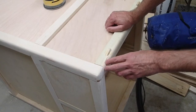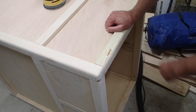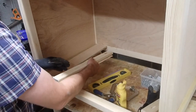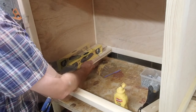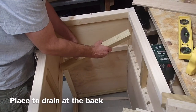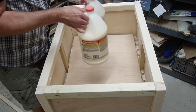And of note, if you're going to use a round-over bit, make sure you've got a smooth edge for the bearing to go onto, as it dropped into the pocket hole and caused a little bit of a happy accident right there. To get in the bottom supports, I'm just going to put a little bit of wood glue on the edges. I have a piece of ply here about 4 inches wide, just to help me keep the spacing off the edge, and I'm going to use a clamp to keep everything nice and level to this beam. And to help secure the support pieces, I'm putting a little bit of wood glue and dropping it into place. And then for the bottom of the soil bag support, I'm just going to put some glue and place the bottom, and add a bit of weight to it.